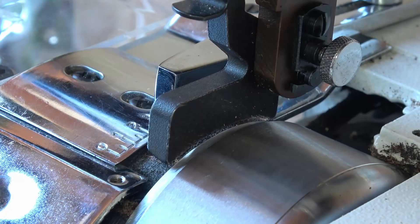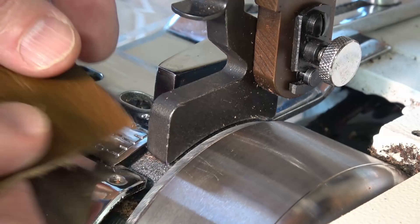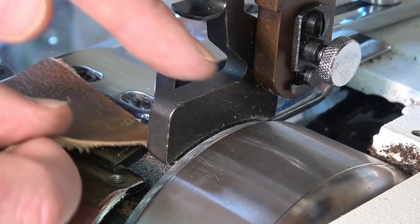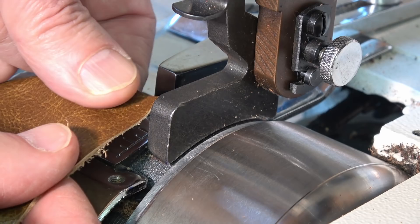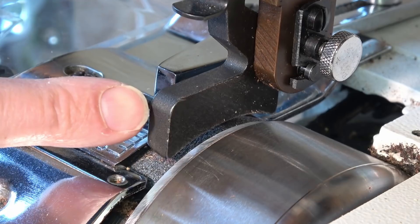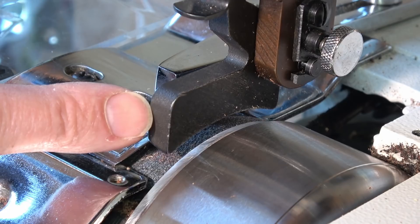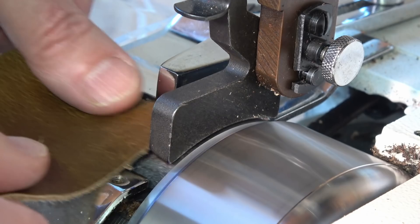Zooming in - what you want underneath this foot is enough gap for your leather to get cut and to pass under. If the foot is too high then your leather won't feed through; if it's too low you'll either hit the driving stone or you'll get a very very thin bit of leather skiving. So it's a little bit of trial and error adjusting that top screw to raise or lower this foot. If I turn it a few times you may be able to see the foot going up, and ditto if I turn it the other way you can just about see it coming down. When it's running, if it doesn't cut quickly and easily, make it a little bit lower - a very fine adjustment.